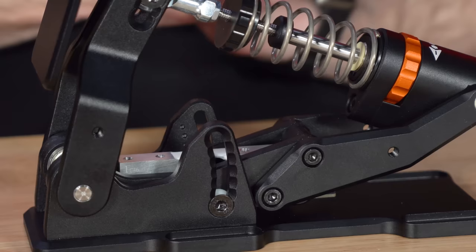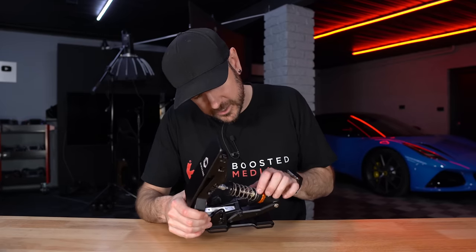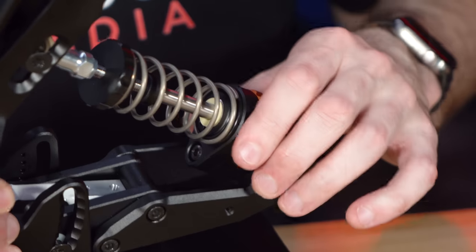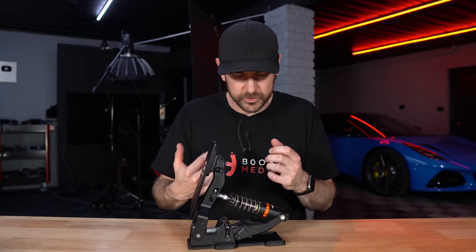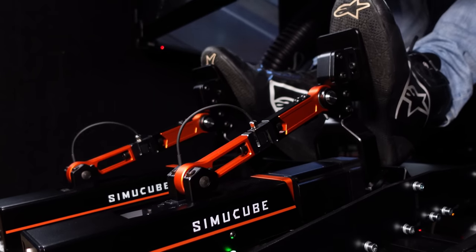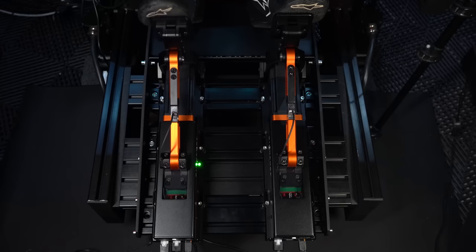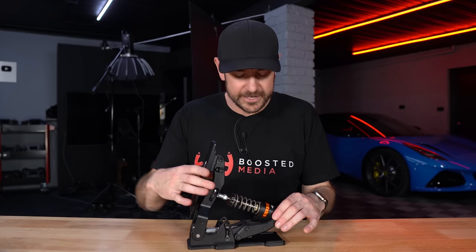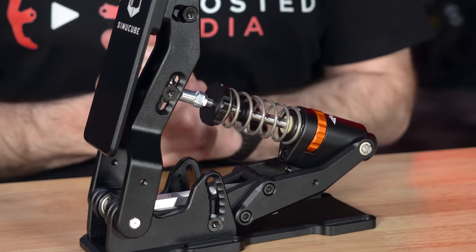In terms of the mechanism, there's a little arm coming off the back of the pivot with a tiny spring inside. As that spring compresses, it increases deflection inside the strain gauge on the load cell, which is then interpreted as pedal position and passed through into the sim. The push rod goes through a Teflon-coated sleeve, giving it a very smooth action with no binding or gripping. One thing I would like to see at this price point is an adjustable damper — having experienced the VNM pedals with really high quality dampers, that did genuinely add a lot to the experience.